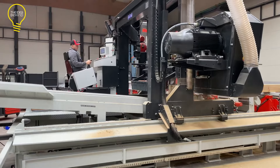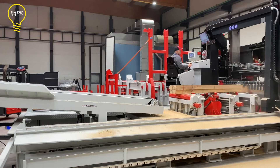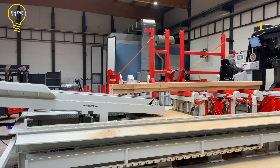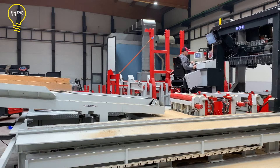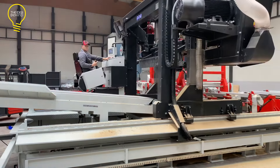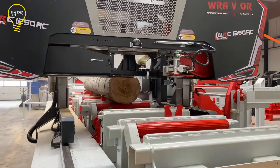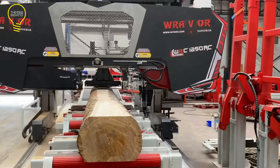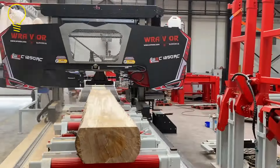The WURC-1250AC has a pre-cutter that adapts to the contour of the log, a pushing board with a guiding hand, and a system for quick log handling. It also includes robust rails made of extra-weld toughened steel, movable log turners, and reinforced support where each roller is height adjustable. The machine also features pressured blade guidances with oil mist cooling, automated oil and grease lubrication, a tracking cutter, and a separate self-standing control panel with a seat and two joystick controls.